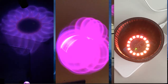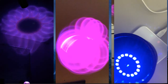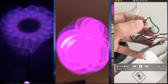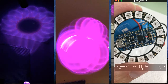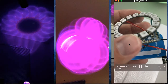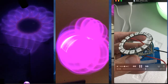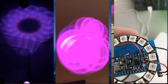You can see this is when I put the housing onto the wireless charging base without the diffuser — that's what it looks like as it starts going through its animations. Here's the circuit on its own: this is the wireless charging receiver, that's the Arduino — I'm using a Pro Trinket 5V — and this is just a 12-count NeoPixel RGB LED ring. They all share a common ground. I have the battery positive soldered into the battery pin on the Arduino, then the 5 volt is distributed from the Arduino to the NeoPixel ring on a specific pin — looks like I'm going pin 3 for this.